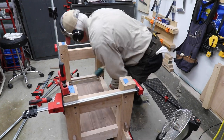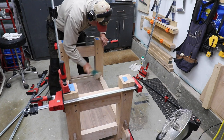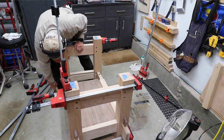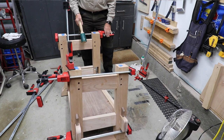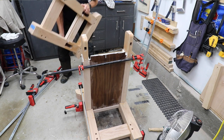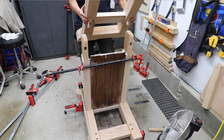Fortunately, in this glue-up I was able to use some wedges in the one end to pull everything tight. So the fact that the glue had set up on one end while I was working on the other end was not all that devastating for me. However, in other circumstances, you can easily ruin an entire project by taking too long in your glue-up and having some things set up on you before you pulled them tight.